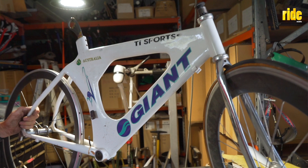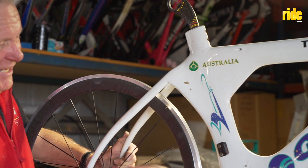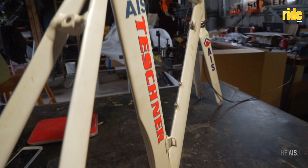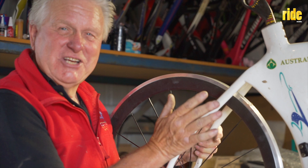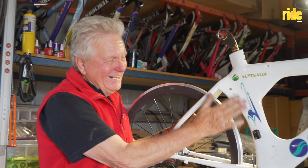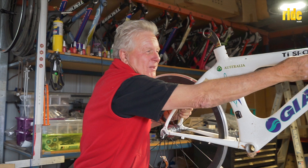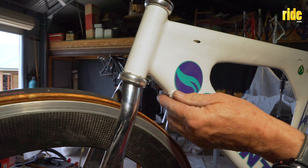You'll notice back in those days there's a fair bit of fairing going on. This frame actually has a seat tube in there — see there? That goes all the way through. What I did with this frame was to build a frame in aluminium and then I made a jig and pumped foam into it everywhere. Then I hand shaped all of this foam. All these details up in there — all these sorts of things have been hand shaped. You can see here how we trimmed back all of the fairing for the internal so there was nothing sticking out.